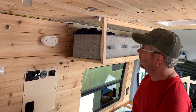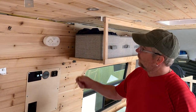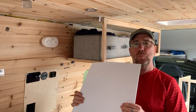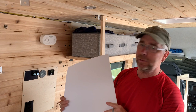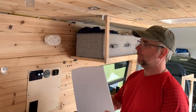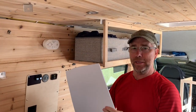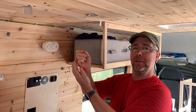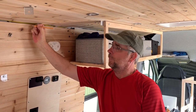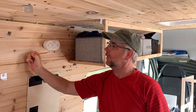I'm also going to use this plywood to put an end on here to keep things from flying off. To get this shape, I've got a piece of quarter-inch foam core from a craft store — you can get it at Michael's. I cut it roughly to shape, put it up against the wall, and scribe the edge. The way I do that is I hold my knuckles right against the wall with a pencil and just drag it right down the wall.